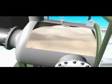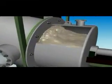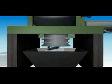Dilution pulper. The dilution pulper acts as a coarse screen. The diluted pulp stock passes through a perforated screen plate of 6 to 8 mm, which separates out contaminant materials like plastic, film, adhesive material, etc., and discharges them into the waste trolley after washing at the end of the pulping cycle.